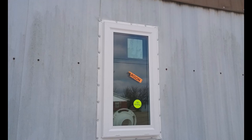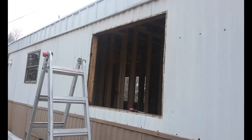Just make sure you get plenty of silicone behind those fins, and clean the siding before you put silicone on. Here's a before shot — we had this big window out, and this may have been the one that took 46 screws. I cannot believe we went through almost 500 screws. Guys and girls, it's really simple — you can probably do this yourself.